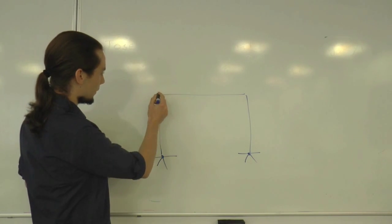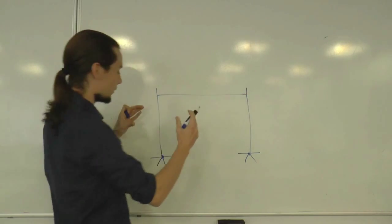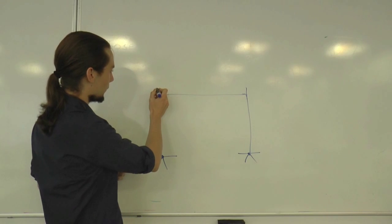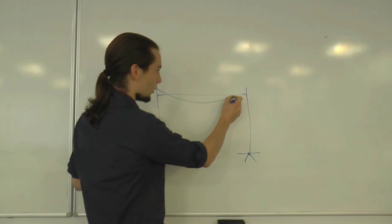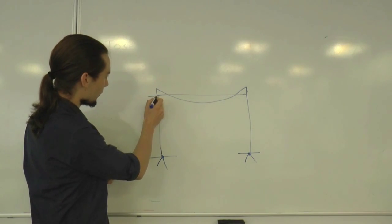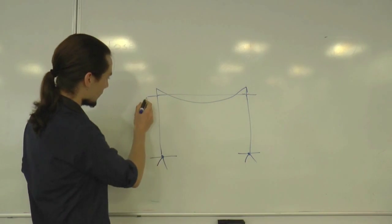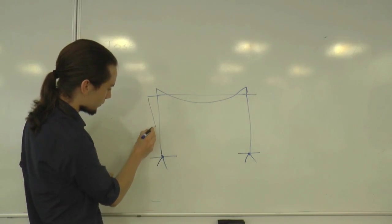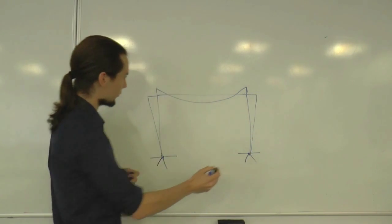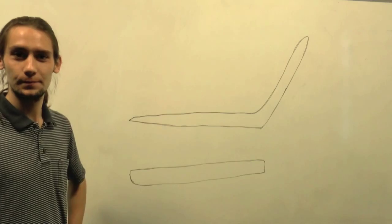And we had the hogging moments at the top, generated by the fixity, the rigidity of these connections at the corners, and then we superimposed our parabolic distribution on top of that. Then these come round the corners, the tension is still on the outside, and there's no moment here, so we get this triangular distribution down to the base. And that's our bending moment diagram for this portal frame model of the bench.